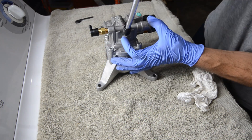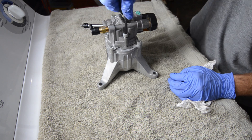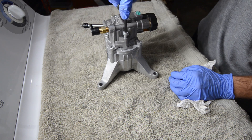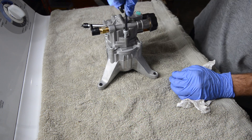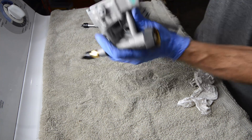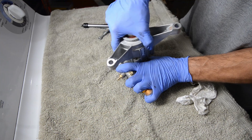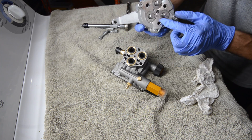You might need an Allen to get in there because you might not be able to reach it if you have a little stubby like mine. I did loosen this one up previous to the video — keeping it real. So we're going to get this last bolt out. Now there's going to be three plungers in here — there's not going to be any oil in it, but there will be three plungers. You're going to want to gently wiggle it up. There we go — there's your seals, and your three plungers that run off the axial cam.